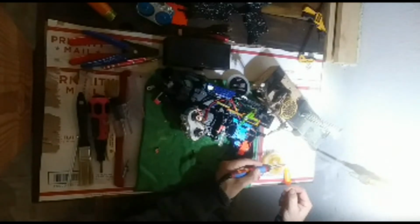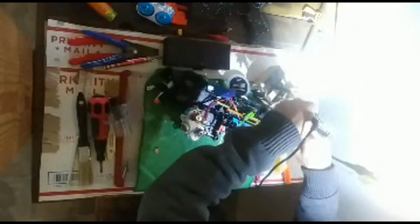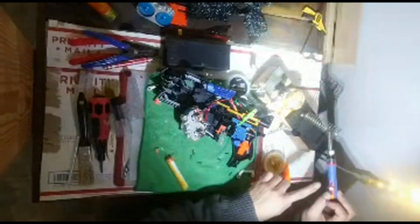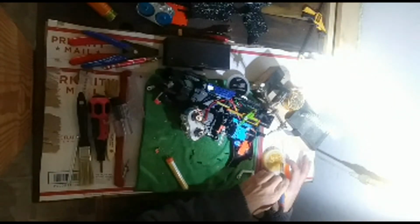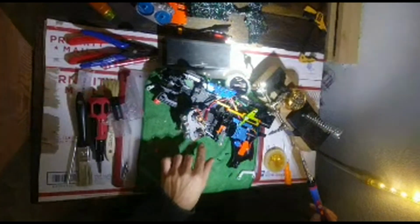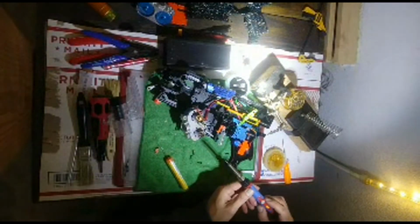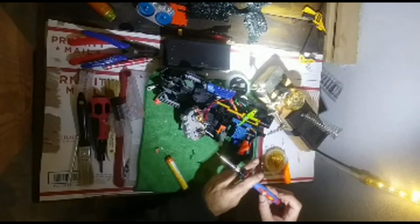If you don't remember to do this, like I always am neglectful to do, it does absolutely affect how the soldering turns out. Also, you get into this hobby, it's good to have a dual range temperature on your soldering iron. Like it was up to 400 earlier to remove the joints or the terminals from the old solder, but that's too hot to reconnect. Everybody has a different technique and likes to run different temperatures, but when I resolder, I like to go around 200 to 250 degrees Celsius.